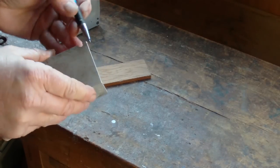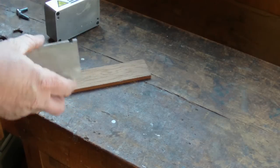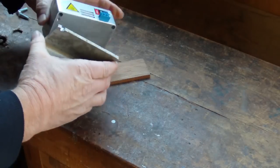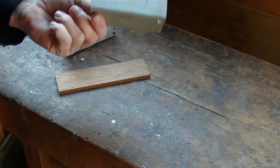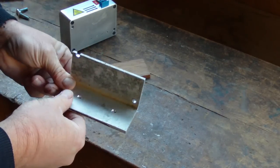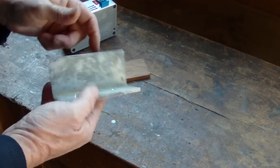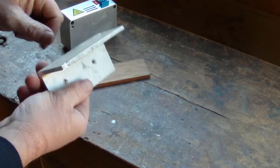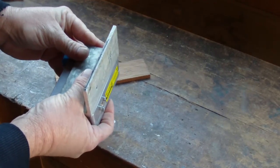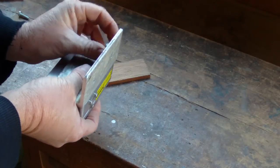At the top here, it's the same, but it's only sort of a half hole that's required here. And in actual fact, if I had say a 60mm piece of angle aluminium, that'd be alright, but I just found 50mm. I had a piece laying about, and it holds it well enough. There's no point going overboard on it. So the next job is to drill out the holes. As you can see, I've already done it on mine, and it should just screw together quite nicely.